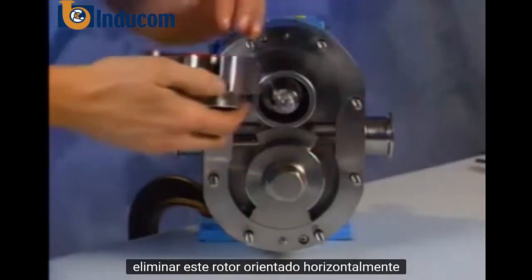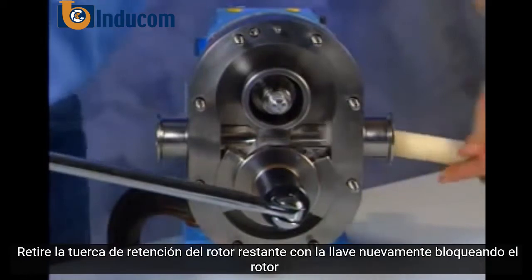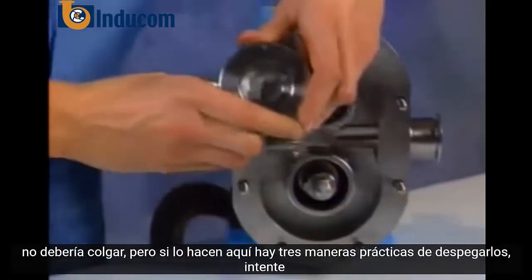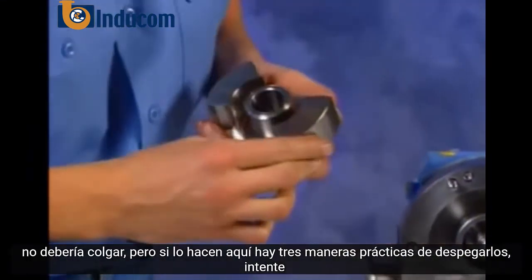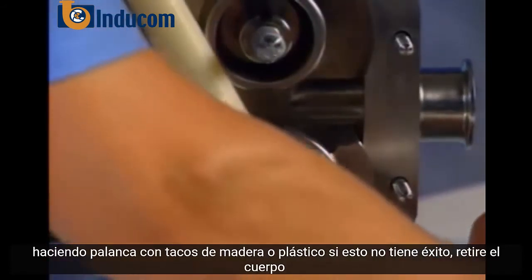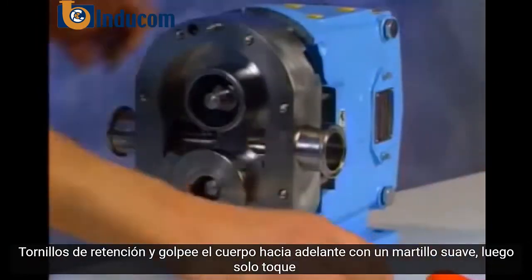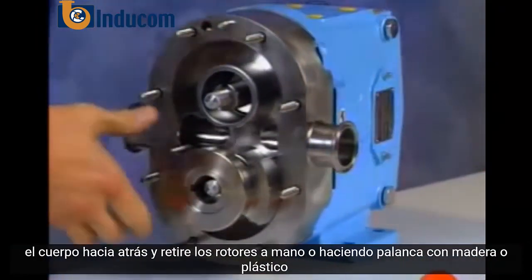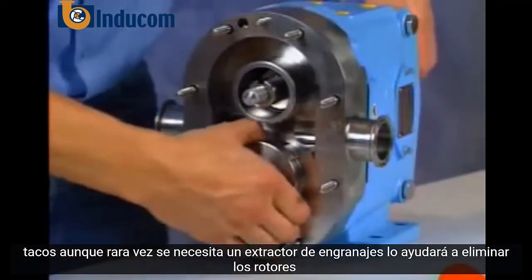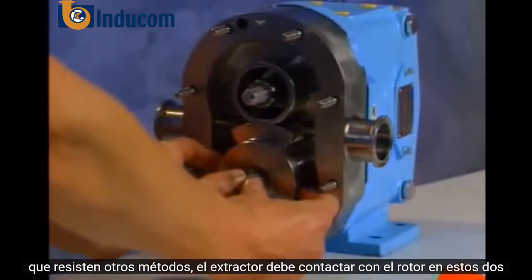Remove the horizontally oriented rotor. Remove the remaining rotor retaining nut with the wrench, again locking the rotor in place with the dowel. Remove the rotor. The rotors are sealed off so they shouldn't hang up. But if they do, here are three handy ways to unstick them. Try prying with wood or plastic dowels. If this is unsuccessful, back out the body retaining cap screws and tap the body forward with a soft hammer. Then just tap the body back and remove the rotors by hand, or by prying with wood or plastic dowels. Although it's rarely needed, a gear puller will help you remove rotors that resist other methods. The puller should contact the rotor in these two places.